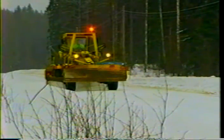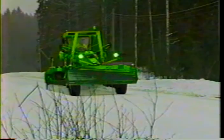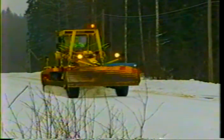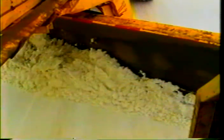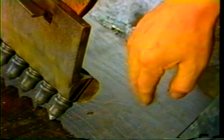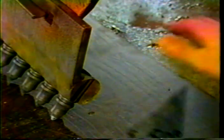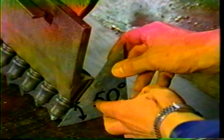To ensure good results and to minimize pavement damage, special attention should be paid to the cutting and grating angle and to the pressure applied against the road. The cutting angle should be set at approximately 50 degrees. This angle ensures maximum contact between the hard metal tip and the road surface.